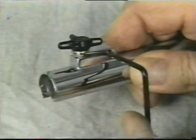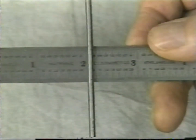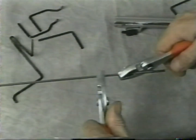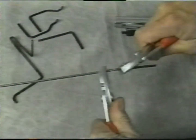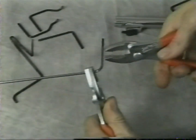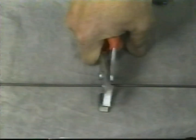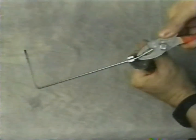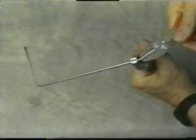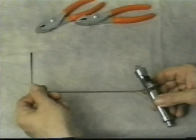Custom guide arms can easily be made and fit just like your standard guide arm. Using exactly 1/8 inch metal wire or rod, bend an angle at one end. Cut to the desired length. And bend the other end appropriate to the project you're striping. Long guide arms must be used with both hands.